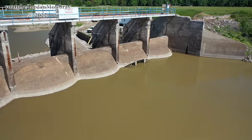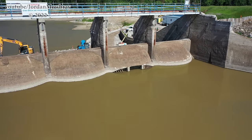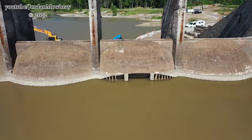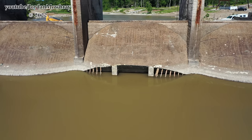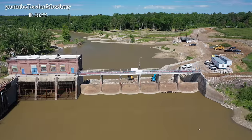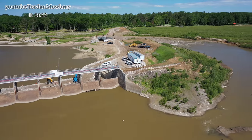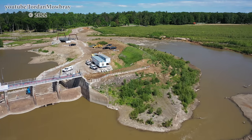You can kind of see where the water line typically is, and that is where the line will be when they use the breaker and remove the top of these spillways — that'll be the water level flowing over the top of this dam. Keeping the camera panning around, you can see that they did remove a little bit more concrete on the sheet pile in the center of the screen. And this is the Sanford earthen embankment — you can see how it was completely made out of sand.